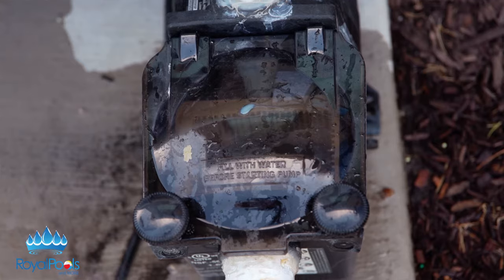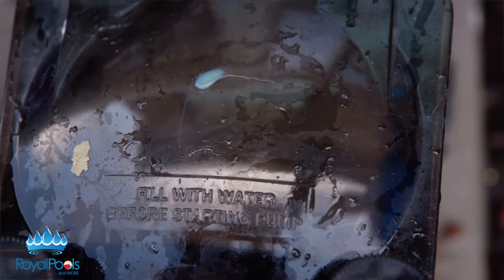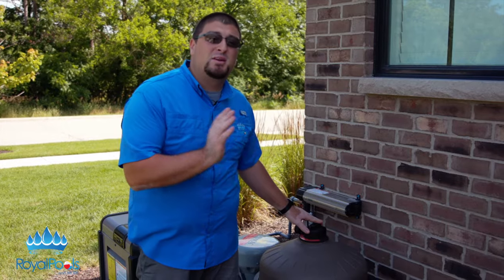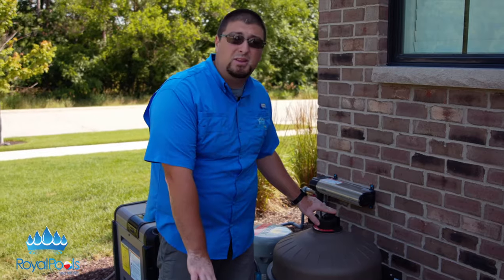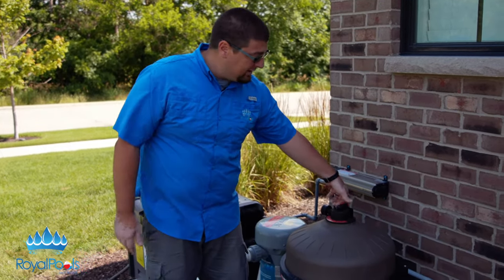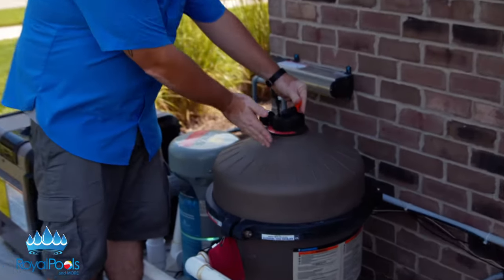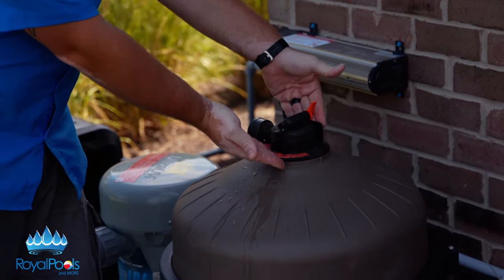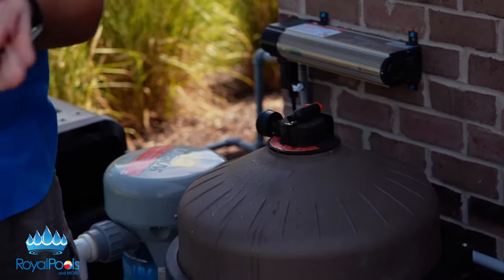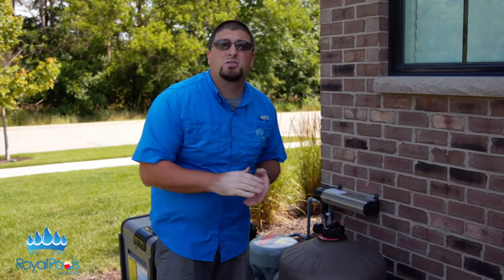As the pump is priming back up, we had some air that got caught in the line here, which is always normal. This valve on the filter, as the system's off, allows air to come in dropping the water level so you don't get your feet completely wet. As the pump is priming, it also acts as a bleeder line. As we open this valve — now the pump is on — it's going to shoot all the air out. You want to bleed it of air until water comes out, then shut it back off. All the additional bubbles after that, if everything is sealed tight, will work their way out naturally through the returns of the system.